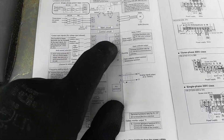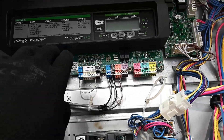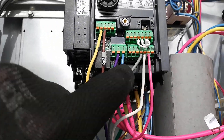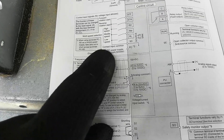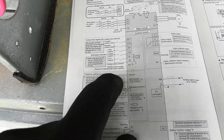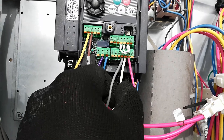Now B and C are easy — this is a fault relay, and B and C are normally closed. So if it opens, our M3 board can tell us that something's wrong with our VFD. Then we have SD, PC, and STF. We have 24 volts DC — the common is SD, 24 volts is PC2, and start forward is STF. So that's our 24 volts DC common and start forward signal.